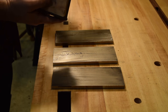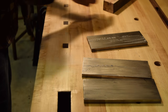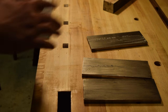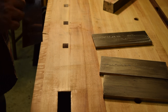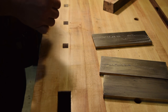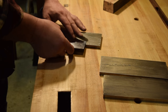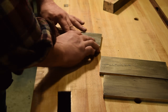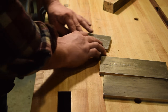When I'm happy with the finish, I'll take it out. Now it has a burr — the metal has been removed and starts to fold out on the side. It will cut and make shavings, but what Curtis Buchanan calls this is a false burr or a false hook. What it is: it's removed metal that will start to break off and you'll get delineations and score lines down your work. So you need to remove that burr completely. You want a nice square 90-degree end — very smooth, no bumps — if you're going to get the best finish on your woodwork.